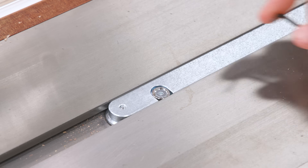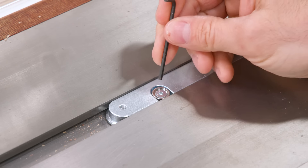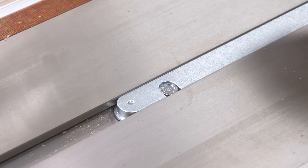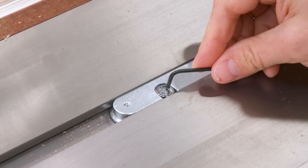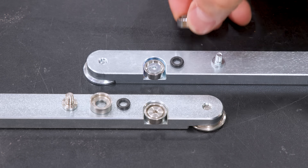So the way that we adjust this thing in the miter slot is you tighten this little screw down, and I think that's pushing on some kind of rubber washer or O-ring, applying pressure to the side. It kind of auto-adjusts, and if you need to, you could put a piece of paper in there to create a little space if it becomes too tight. This is very similar to what I've seen on the Jessam. Looking at the disassembled parts: you've got a little metal washer and a rubber O-ring. As you put a screw in and apply pressure down, it extends that O-ring and forces the washer to rub against the miter track — pretty much the same exact setup as the Jessam.